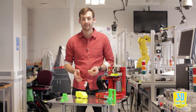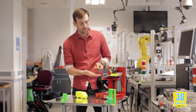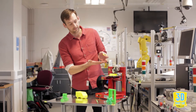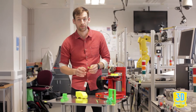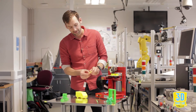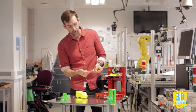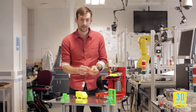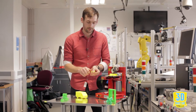One of the first design considerations we want is for the strength of our piece. We print horizontally on a 3D printer and we build our layers up from the bottom. What we want to do is make sure our pieces are as strong as possible. Our strongest element is to go with the grain. Let the piece flex with the grain. Its weaker point comes on the shorter span as we go up the grain. For our moving pieces we want to get as much of that long grain in as possible — that way we keep the strength.